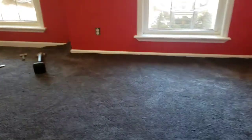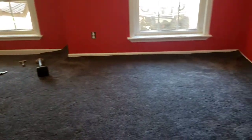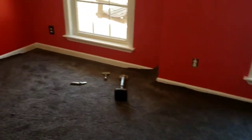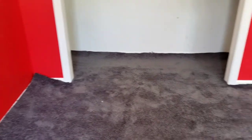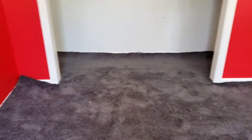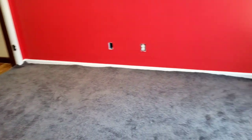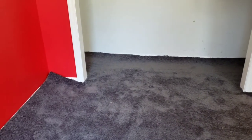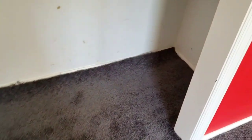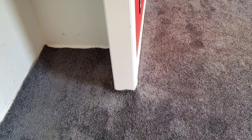What I've decided to do is get that long wall on the front kicked up and tucked in, then work my way across the room into the closet. But before you start trimming, you want to make dang sure that everywhere has a little bit of extra evenly all the way around. Because if not, you get to fine-tuning it in one corner, and then when you get to the other side of the wall, you're going to have issues in that opening or somewhere else. Triple check that there's a little bit of extra everywhere.